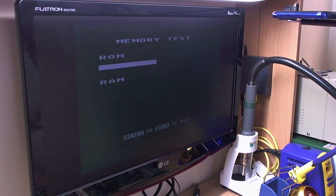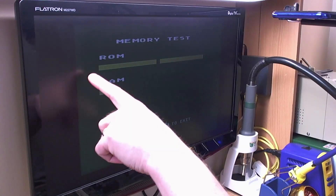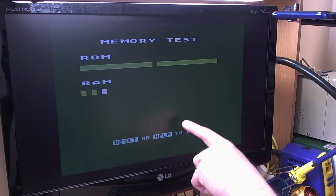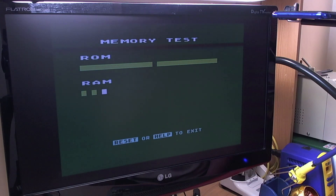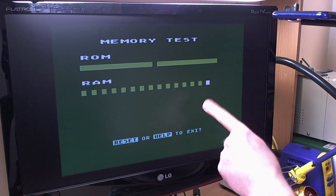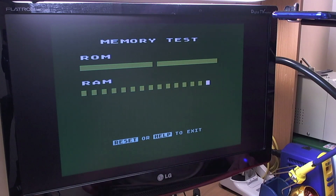We go straight to the memory test, so we appear to have a RAM issue. We've also got a video issue as well, so we've got several problems here. Since Freddy generates the clock - the crystal is fed straight into Freddy and Freddy generates the different phase clocks for the system - I'm wondering if this pulsing effect has anything to do with the power-to-Freddy issue. It's found bad RAM.